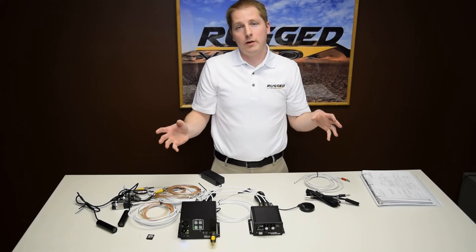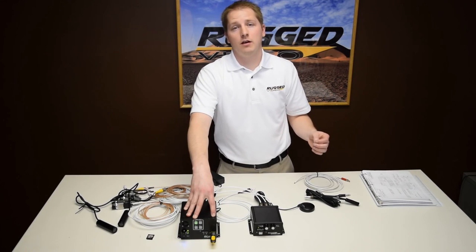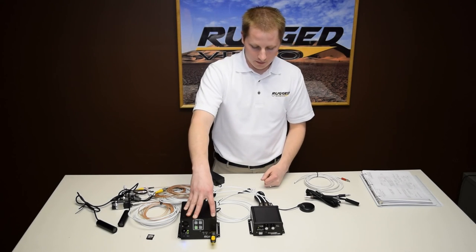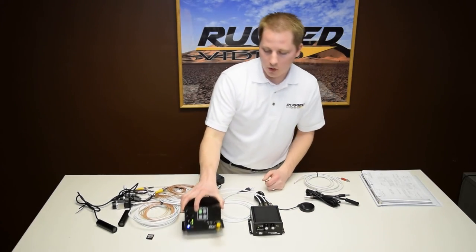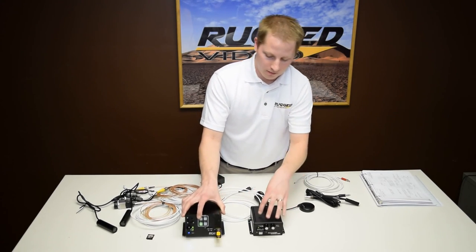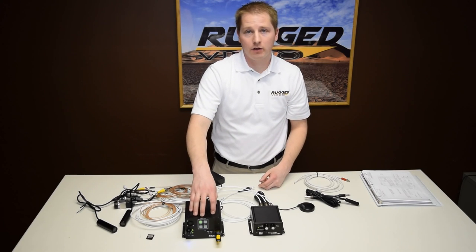You should notice the system is switching between cameras — this one is configured on a five-second timer as a default. Based on GPS you can set different waypoints in different areas where you want to record, choosing between three cameras, two cameras, or all four. That's configurable throughout the entire flight. It also uses directions — so let's say you're flying a coastal tour: as you're flying up the coast it might only use the left cameras, and when you're flying down the coast it may only use the right. This can also control recording. You'll notice the blue light — the GPS was actually configured for the commander controller and we see it is getting valid GPS data from the commander. What's nice is the unit can still use that GPS data to overlay things like heading, speed, and coordinates on the video.